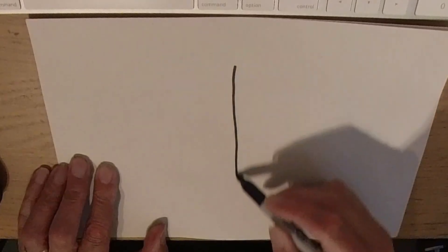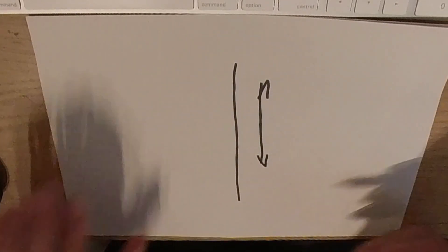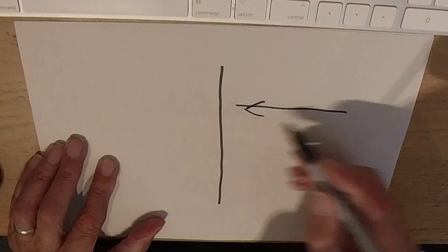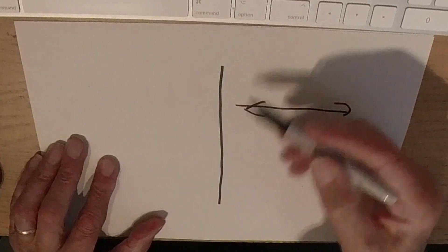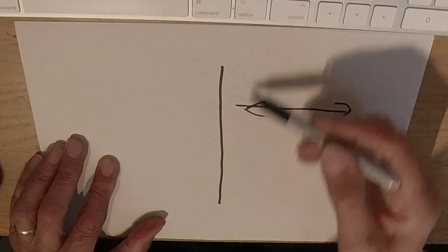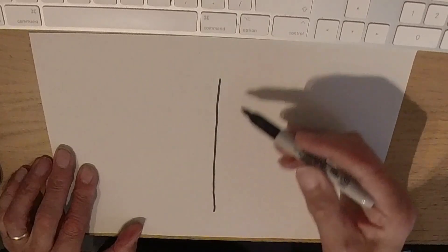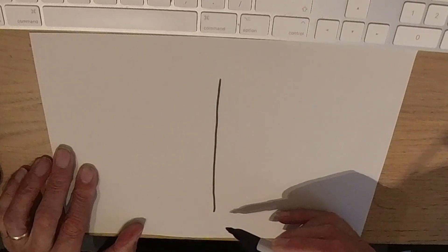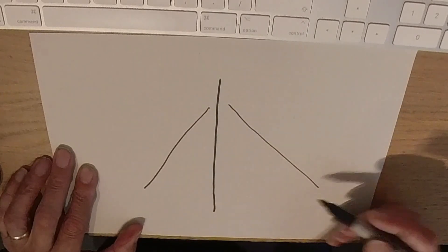The strength of a fiberglass pole is in the vertical — it's very strong in that direction. But it is a lot weaker laterally. Pull it sideways and it will bend; it probably won't break, but it will bend because it's flexible. So it's not so good in supporting lateral loads. Its strength is in the vertical. There are three antenna scenarios in which it is really good: run a wire up the vertical to form a vertical conductor and you've got, for example, a quarter wave vertical — it's very strong in that respect. It's also good as an inverted V support, and that works extremely well.